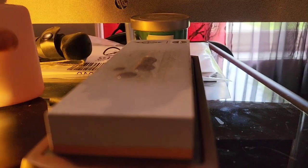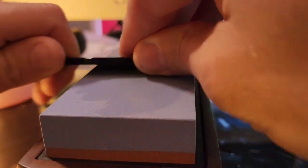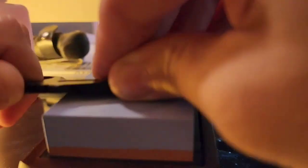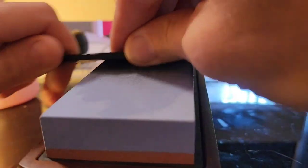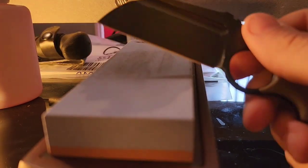I can just start to feel a burr. Now I'm going to throw a little bit more oil on there, wipe down the top and get rid of any debris, and do it again — just find the same angle. That's the main thing: finding that same angle. You can hear that little grinding sound — that's where I'm hitting the ricasso right there. Once I get a burr on both sides, and the burr gets smaller and smaller, now I know I can flip it over. You can see how nice that edge is right there.